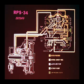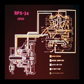When the selector lever is in high, the selector spool is positioned to engage the C2 and C3 clutches. Pressurized oil is directed into the C2 pilot circuit, which is routed through the C2 shuttle valve and the opened C2 retard check ball. The C2 pilot is actuated, permitting pressurized oil from the supply gallery to pass through the pilot and into the C2 clutch.